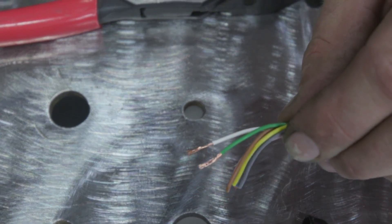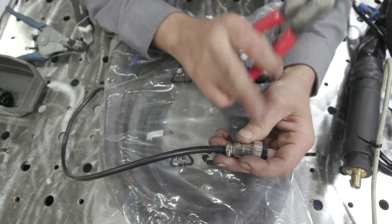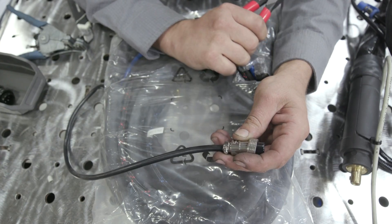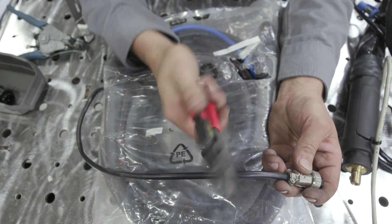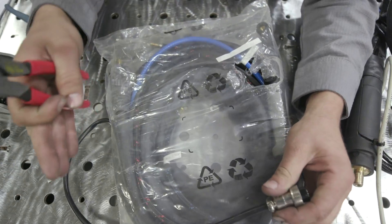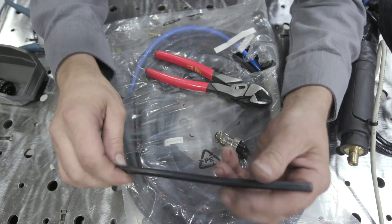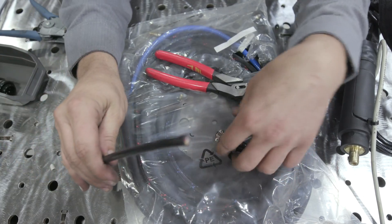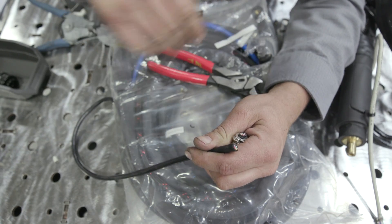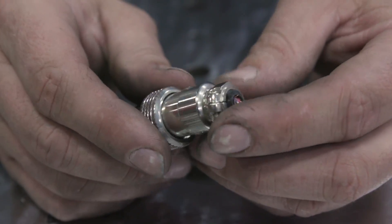Here's our victim. I made sure this fit on the machine. We need this connector - we're going to figure out how it's put together and which pins are being used. We're going to cut it - but don't cut it way back, that's stupid. You want to leave as much wire as you can. Cut it way up here because in the future you might want to put this plug back on. Always leave wire even if you think you're never going to use it - a year from now you might. It happens to the best of us.